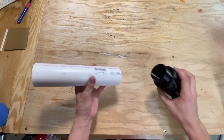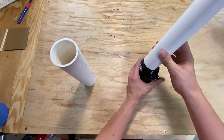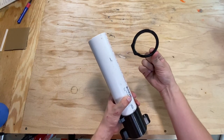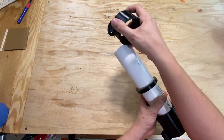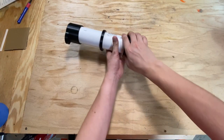Let's start off with the front half of the launcher. Grab the outer barrel, the breech, and the inner barrel. Take that inner barrel and insert it into the coupling on the breech. The outer barrel will then just slide right over it and fit into the breech as well. Then grab your front sling mount and position that over the barrel. After that, you can attach the front sight to the outer barrel. Make sure that the front sight and the breech are aligned so that your aiming point is going to be correct.